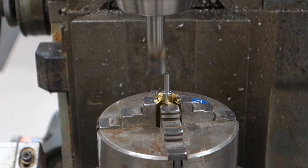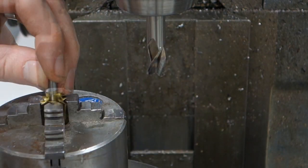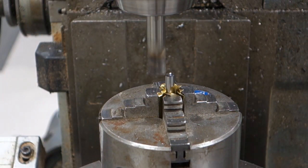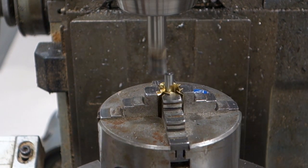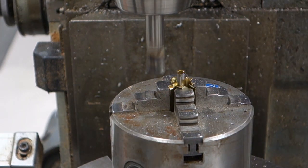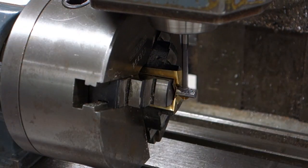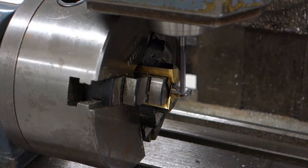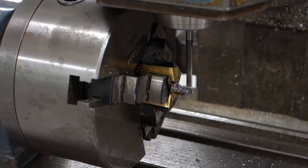If, like me, you forget to use a reamer and cut it off at the wrong size, then mill down the ends to the proper size — mill down about half the surface diameter, then mill away another millimeter extra to create the key.